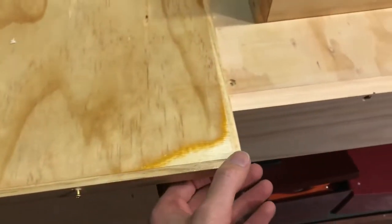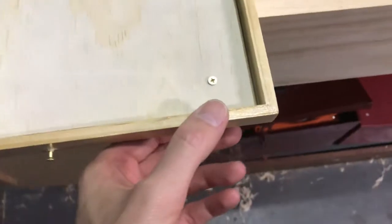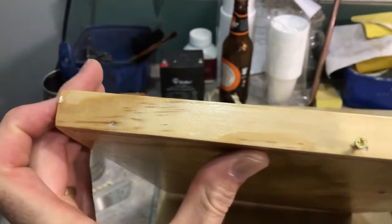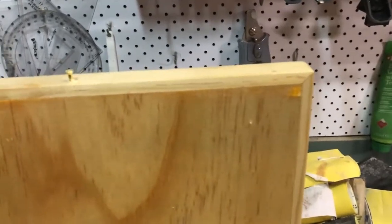In terms of the lid it's just a piece of 7mm ply, and I just put some 20x8 edging around it — mitre jointed, glued and nailed into the edge, and then just planed nice and neatly. And I'm just holding this little piece of veneer with simply four screws, so that if it ever gets burnt or damaged from the heat I can just replace it easily.